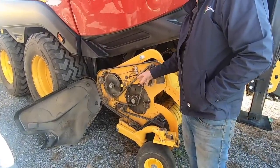So that was the only problem I ever had with the pickup. Now, it's a shorter chain on the VG940A. So I'm going to interrupt the video here a little bit. Where that idler sprocket is, way up at the top where they're pulling on that chain, there is no need for that thing to even be on there. There is right hand and left hand flighting on that accelerator on the other side, right? There's right and left hand flighting.